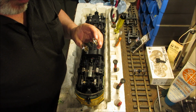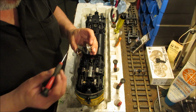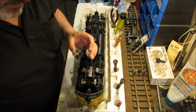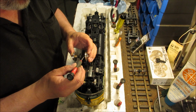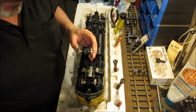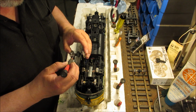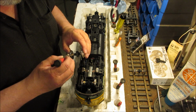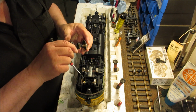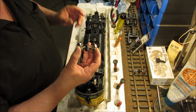I use a pneumatic tool oil for lubricating. I've been using it for 30-40 years. It's been working quite well for me. Right from my American Flyer back to the days when I was in HO. It's very compatible with plastics, rubbers, ferro and non-ferro metals. It works really, really good. And it is multi-viscosity. Okay, so there we go. Alright. Now, I'm just going to wipe off some little excess oil that fell on there.